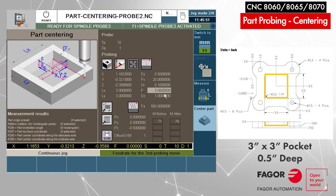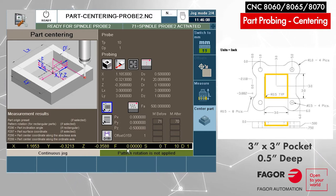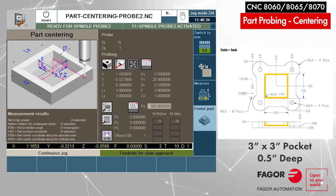How fast to do the second touch: three inches per minute. When we finish touching the X and Y coordinates on the sides, we want to move Z up. For the final surface touch we'll use one-inch safety distance. Do you want to apply angle rotation? We're not going to apply pattern rotation at this moment. We have two choices for the approach feed rate between measuring points: slow or fast — rapid is full speed. I recommend going slow. When I say slow, it's still pretty fast — 500 inches per minute on my machine.